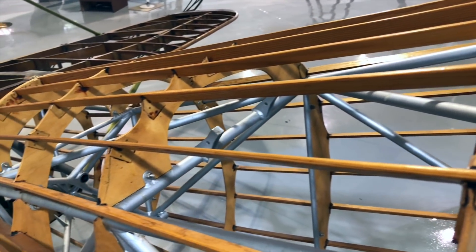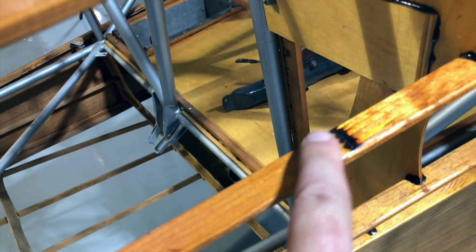Contrast the all-aluminum Bonanza with a wood construction aircraft and you just see the intricacy. You can imagine the number of man hours it took to build something like that compared to the metal airplane. Every little joint you can see glued, nailed, filed, fitted — little blocks of wood for support structure and everything. Complex shapes like this — you'd have to bend the wood probably by wetting it or exposing it to some humidity. That's why it took so long and these things cost so much.